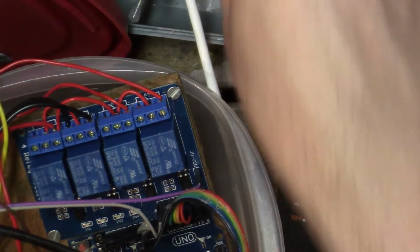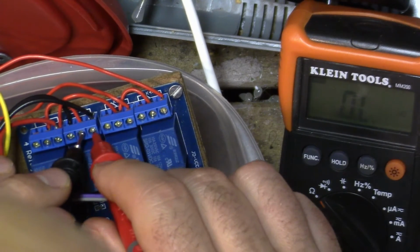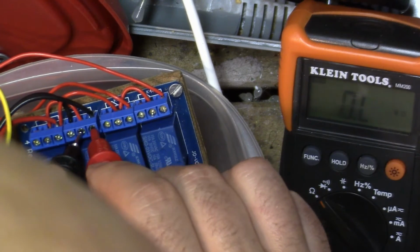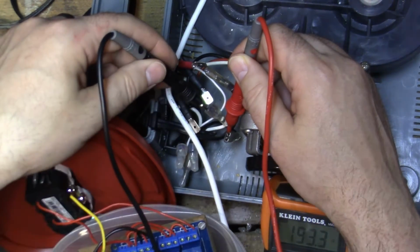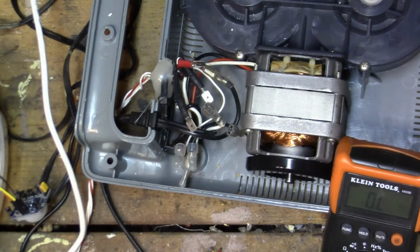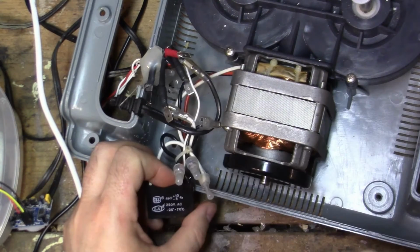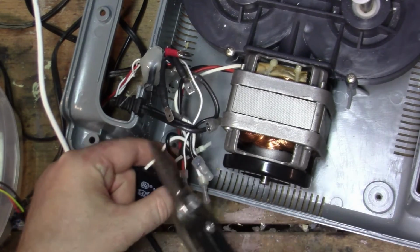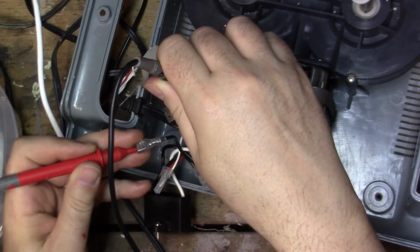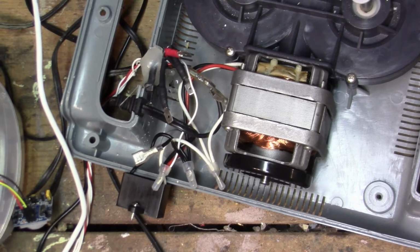What happens if I disconnect both of those up here? Maybe there's some kind of connection inside this little thing up here. And now it's 0. And so is this. There's that 194. So it's not the relay. What is this thing here? Let's find out. This is normally how my props go. This is a capacitor. I wish Dave AVD was here. Probably get this figured out in a jiffy. Coming off of that is this and this. It is a capacitor. The voltage is slowly dropping out of it. It's not the relay. It's not the amperage. I just don't understand what it is.